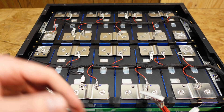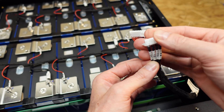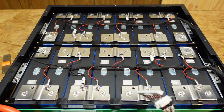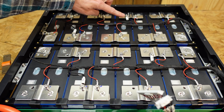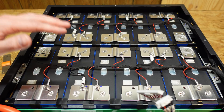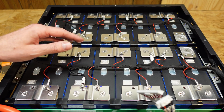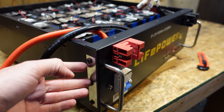I also noted that this battery has four temperature sensors. The second BMS connector is labeled T1 through T4, and those four sensor locations — T1, T2, T3, and T4 — are all bolted down to the bus bars of the series connections.